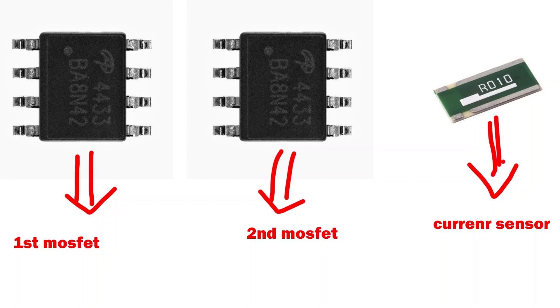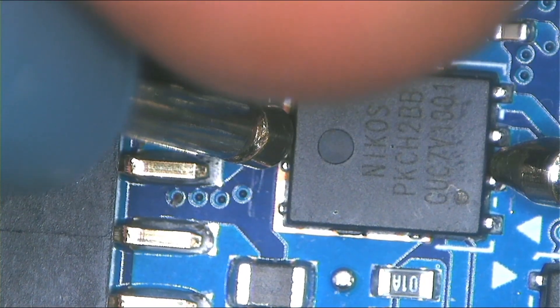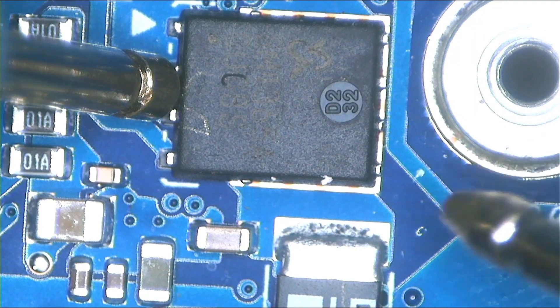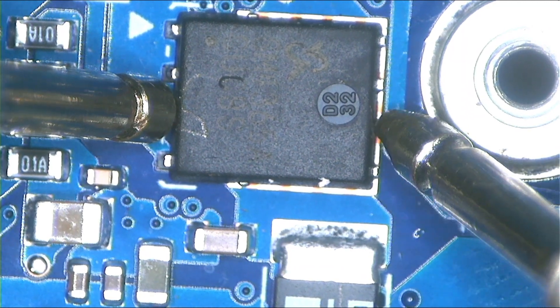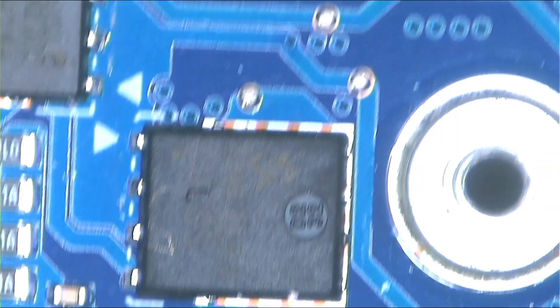In this case it's turning on and working fine but not charging the battery. The client brought a brand new battery, but unfortunately the laptop wasn't charging the new battery either. To check for a short, we check on both sides — if it's beeping, that means the MOSFET is shorted because it's allowing power to pass one way. In this case, none of these MOSFETs are shorted, so there is no problem with the MOSFETs.